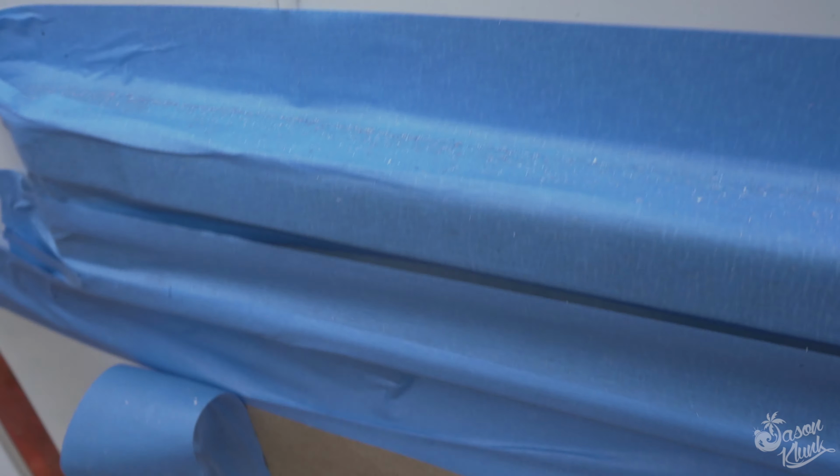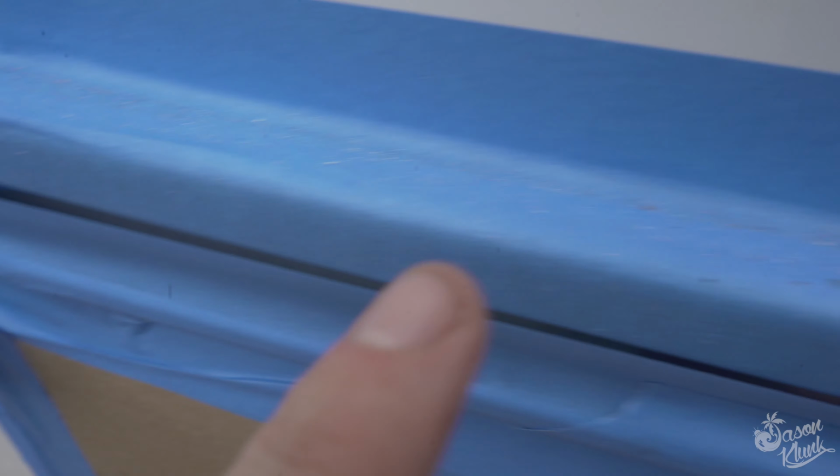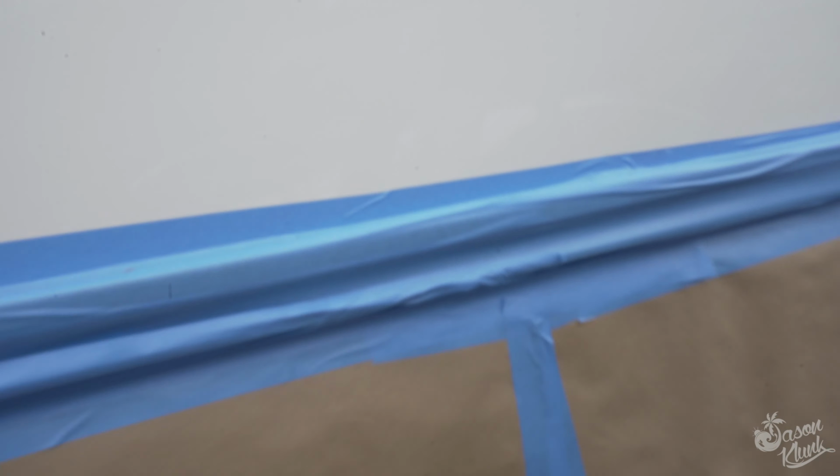Here's what I'm talking about. Yeah, I don't know if you can see this. All these shavings, these would all be behind this piece of metal and they would all rust. And then you'd end up with yellow streaks down your van. We're gonna paint this with rust preventative primer, wait for it to dry, and then pop the frame in.